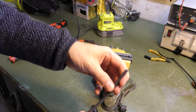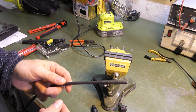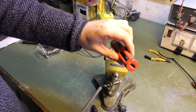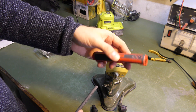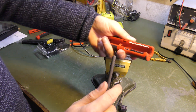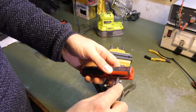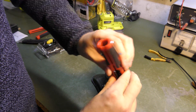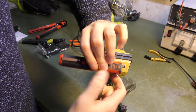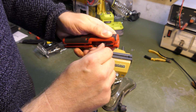I am making cables for the solar connectors. I went out and bought some very nice solar cable — it's not cheap; I got 15 meters and paid about $25 for it. My cousin gave me a tool to remove insulation, and it has different measurements on it for different wire gauges. The inside is six millimeters, so I clamp it in, move it around, and at some point the insulation just comes off. I didn't clamp it enough the first time, but there we go.